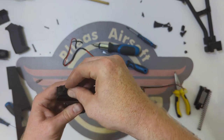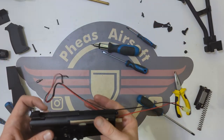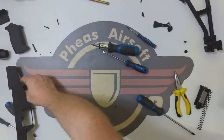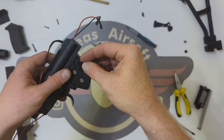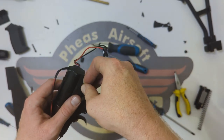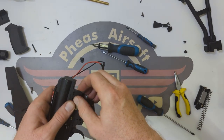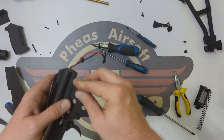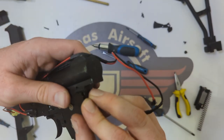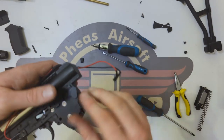Now I can drop the button back in at the top and push it back. I've got the little gear clip there because I don't want that gear exposed when it goes in. Next thing to do is bring back the selector cam — I'm going to flip that over. This gear drops in on this side and those teeth all need to marry up nicely. That is how it should go — it looks like there is one extra tooth on here than on there.